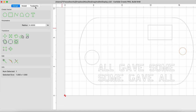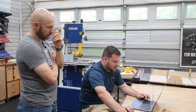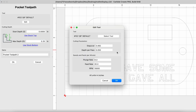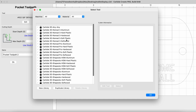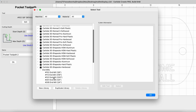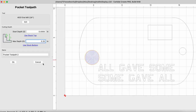All the bits that we're using for this project are from Bits and Bits. I'll leave their information below if you want to pick one up for yourself. These two are going to be the same bit — we're going to pocket those. The thing is, are they going to be the same depth? No, so they won't be the same. That coin is about 0.14 inches, and we want to cover it with clear epoxy by a little bit anyway. I would want to keep it fairly thin — I'm thinking maybe a quarter inch depth at max.